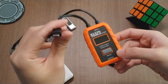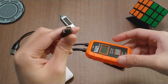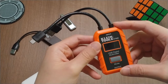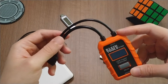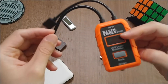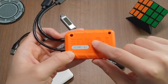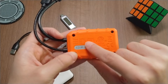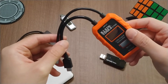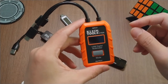Why do we want the USB-C connector? Because most Android phones right now use a Type-C port, and most newer electronic peripheral devices use USB-C for charging. For example, the Google Pixel phone, and starting from iPhone 11, Apple uses their fast charge system with a USB-C to Lightning cable. The input voltage it supports is 3V to 20V, with up to 3A on USB-A and 5A on USB-C. You can also use this tester on Apple Thunderbolt connections, and it supports all quick charge and PD charging — it's a straight-through data connection used to control charging speed.